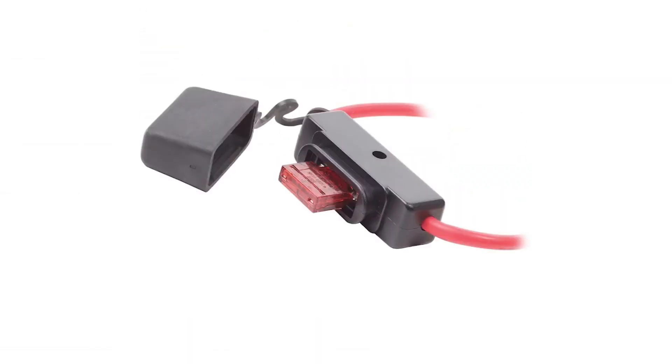When choosing the size of the fuse, make sure the wiring can handle the load. When you're choosing a fuse holder, it's not going to be a problem in this case because a 100 watt solar panel is going to be outputting maybe max five or six amps total. So 10 amp is really good. But make sure your fuse holder is sized to handle the maximum amperage.